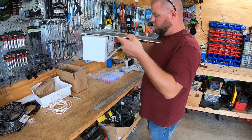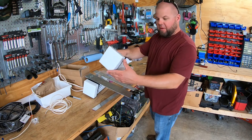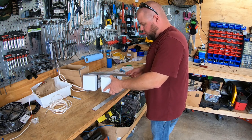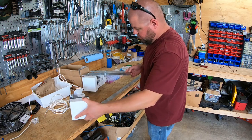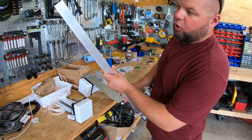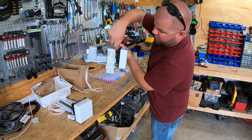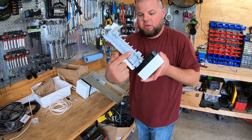I've got the ice maker removed and the wiring disconnected. Long story short, I bought the same exact ice maker — all the links will be down in the description. We're just going to install the new ice maker right here beside the other one so we can have twice the production. To accomplish this, I went and bought some aluminum flat bar from my local hardware store, and I'm going to bend and make tabs the same way I did here, that'll drop down to mount to this ice maker's tabs.